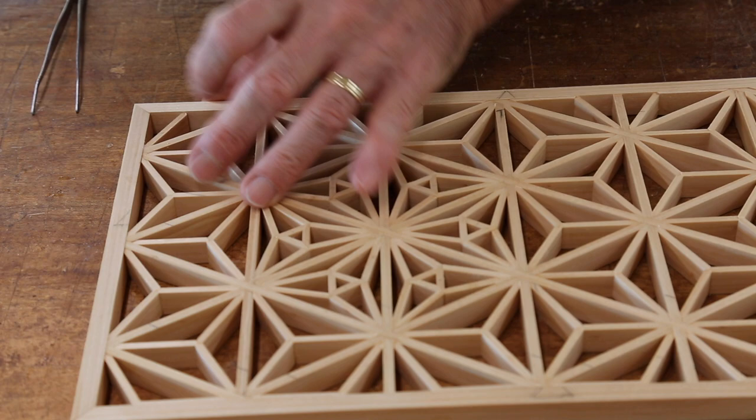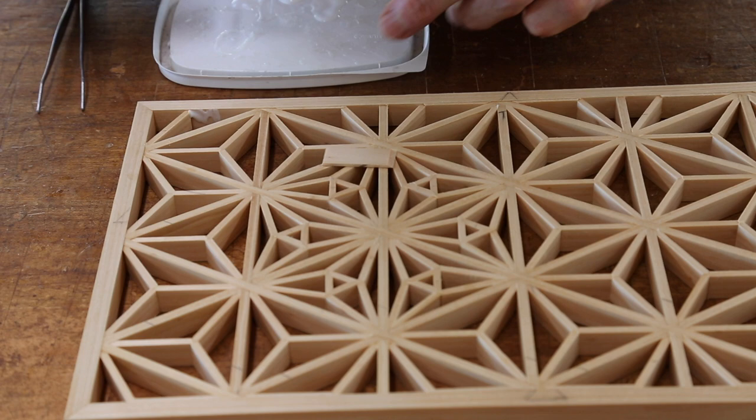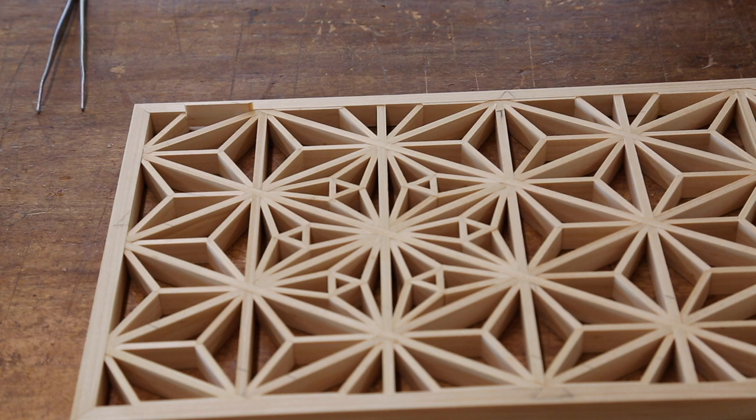This process is not a one-size-fits-all. Some of the more complex patterns will have to be assembled, then carefully cut in half before inserting, or inserted into the jigumi, then cut in half when the jigumi is trimmed to fit the tsukeko. The asa-no-ha pattern, though, is fairly straightforward.